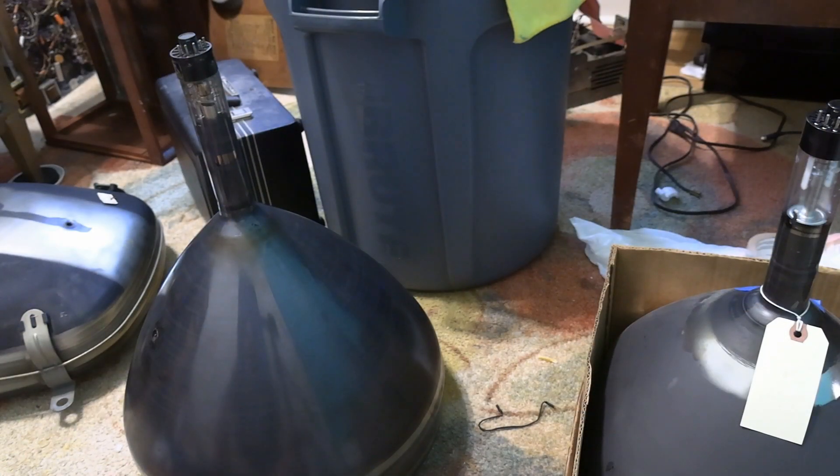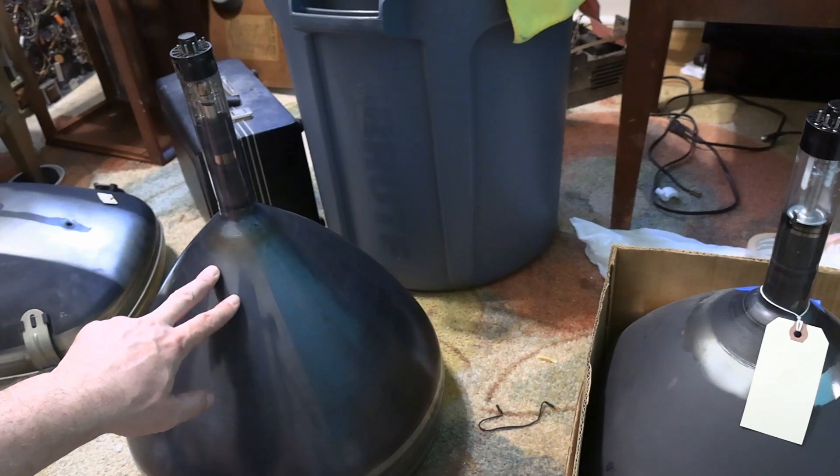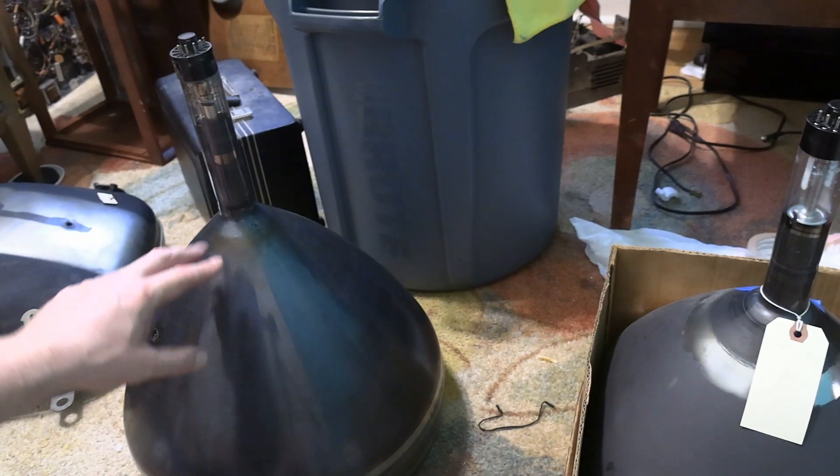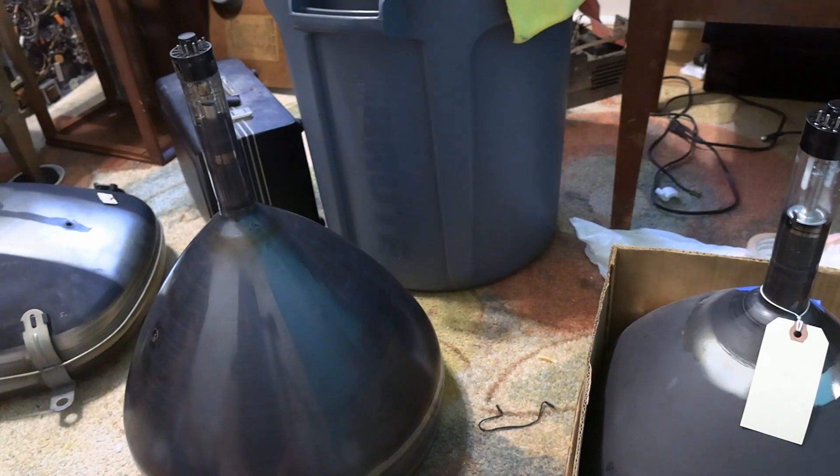Now you may notice something different about the two outside CRTs. Aside from being rectangular, they're shiny, whereas this one is dark on that interior coating. The early CRTs used a graphite-type conductive coating, then phosphor on the front, probably clear-coated with lacquer to protect it.